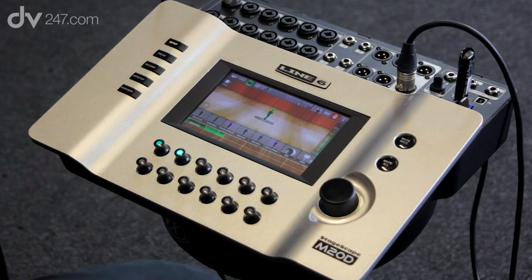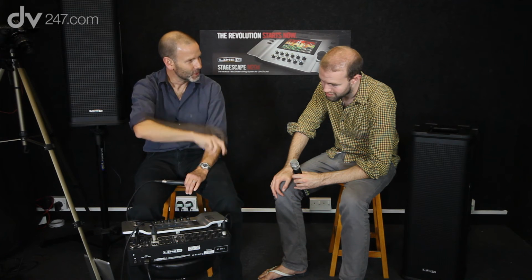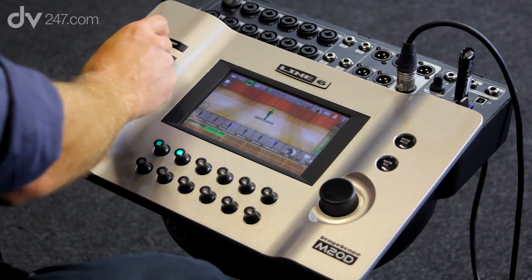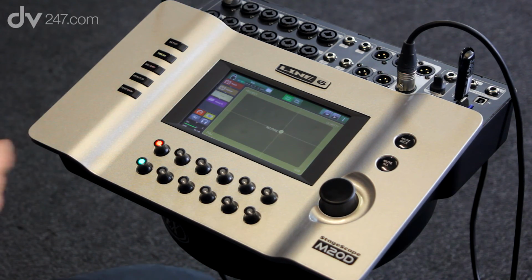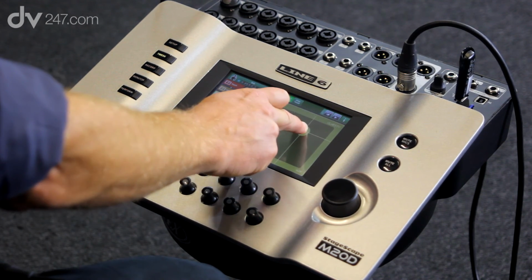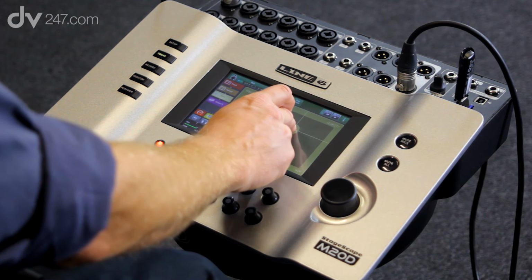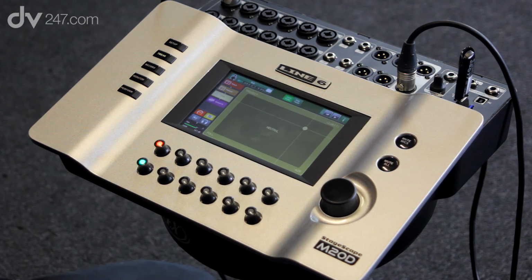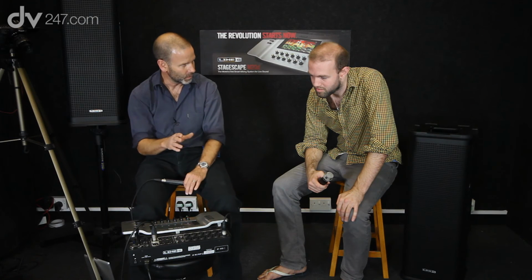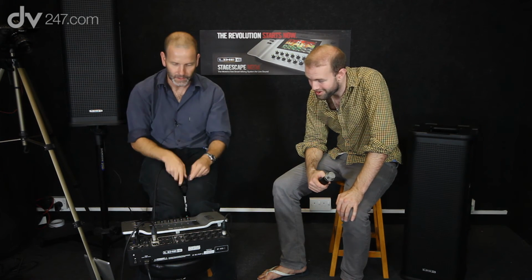But an example of this is Bob. On the first layer, we were talking about left brain, right brain stuff. One of the things that sound engineers do very well is translate the word boom into numeric adjustments on an EQ, right? So our first level is we can go into tweak here, and somebody says, well, Bob's not very clear. Can you make Bob clearer? So we have this XY pad here, and you can put your finger on this button and simply move it towards the word clarity, which hopefully means Bob will sound clearer. When Bob sounds as clear as you want him to sound, you just stop moving your finger. What this is doing under the hood is controlling multiple parameters on a parametric EQ. So it's like your sound engineer growing a couple of extra arms and simultaneously tweaking all the adjustments.